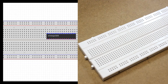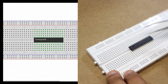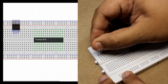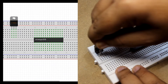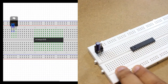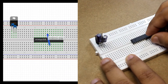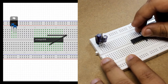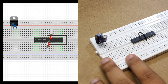To start, place the Atmega IC in a proper position in the breadboard, making sure all IC pins are inserted correctly into the breadboard holes. Put the voltage regulator to the side. Connect bypass capacitors. Connect pin 8 with pin 22, and connect pin 7 with pin 20.